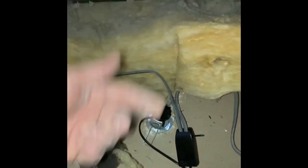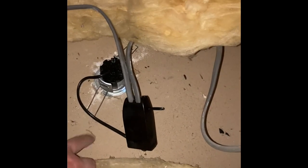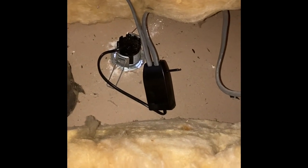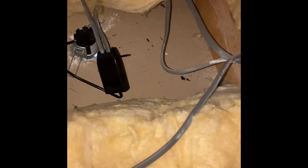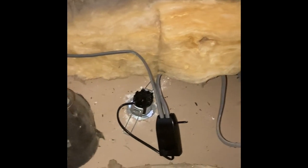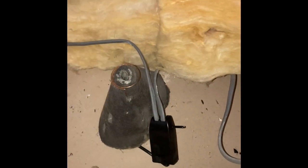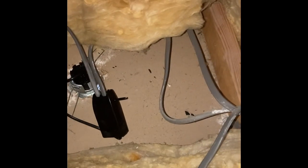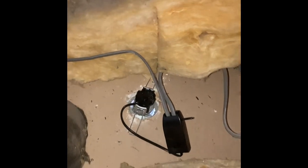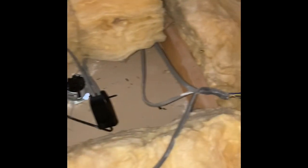It blocks all these little holes if it gets really hot or if flame touches it, stopping the fire from spreading up. The new ones, being fully metallic and completely sealed, are the equivalent fire rating of plasterboard - plasterboard doesn't burn easily, but it gives people a chance to get out. I'm going to reuse these hoods and put them over anyway - they don't need to be, but I'll use them to keep just a little bit of air circulating around the units so they don't overheat.